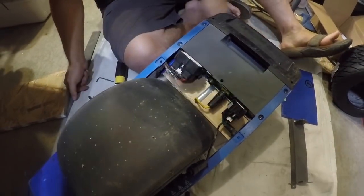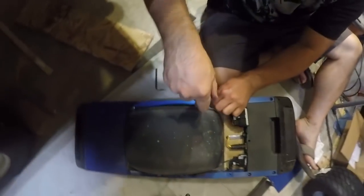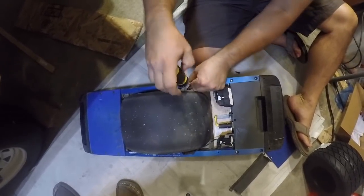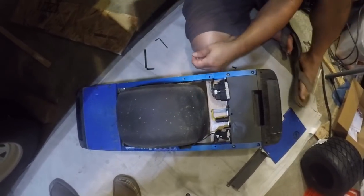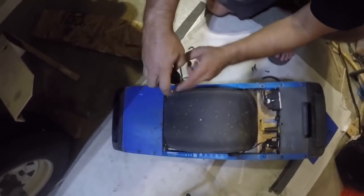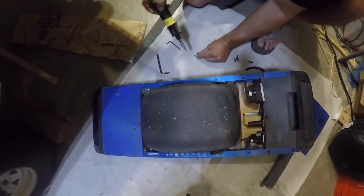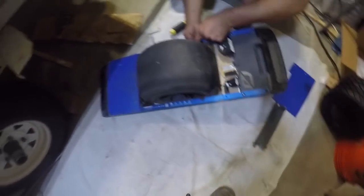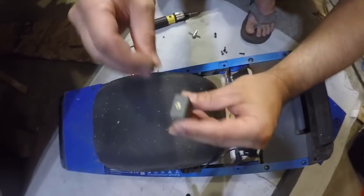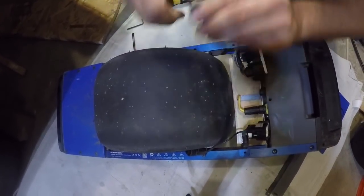So the next thing — once we've got those out — you take out the three screws on the bottom here on the rail. There are three tiny screws you want to pull out of the rail, and what those hold are basically little clips that neatly hold the wires against the rails. Pull it out — there's one, two — and then you can pull the clip out and it slides right out. I like to put the screw right back into the clip so you don't lose it.